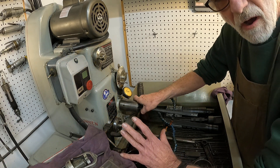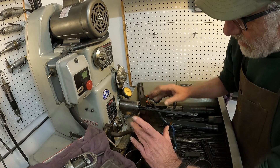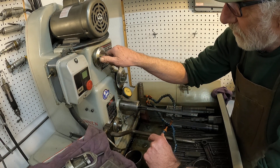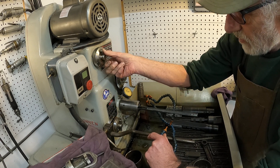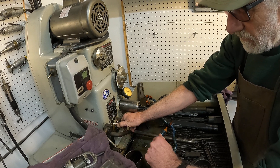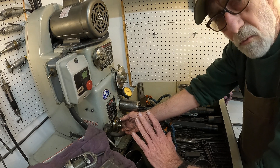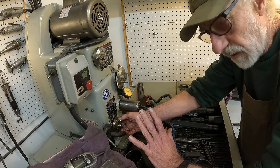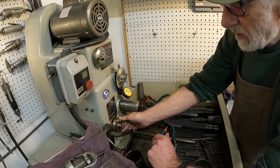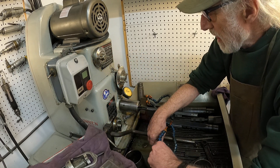I talked about rigid honing — this machine offers semi-rigid. The old hone had a gear drive, while this machine uses spring pressure. There are two dials for honing pressure: up here is your fine pressure dial, and down here is for your medium to high pressure. The older model machine, like the model 1290D, is very much like this but doesn't have the upper fine spring pressure dial — it just has the one dial down here.